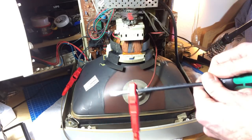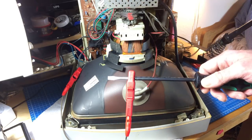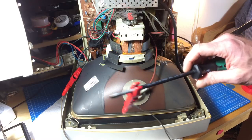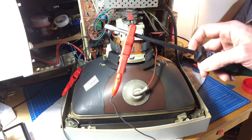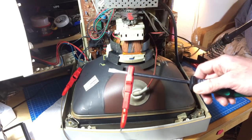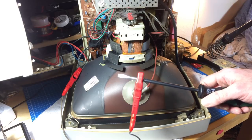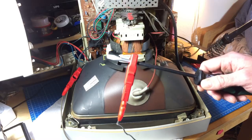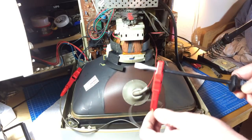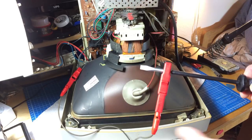Here's the tool I'm going to use — just a normal screwdriver with a plastic grip. I've put some insulation there for safety in case I slip. I'm using a big clamp. The voltage is high but the current is very, very low — still pretty dangerous though, because the high voltage is enough to seriously hurt or kill you. I've connected one side to the chassis ground of the monitor, and the other side to this screwdriver.